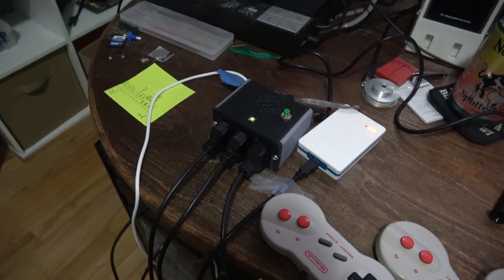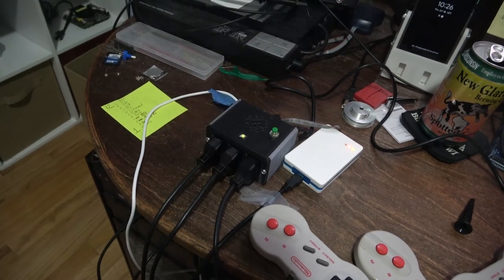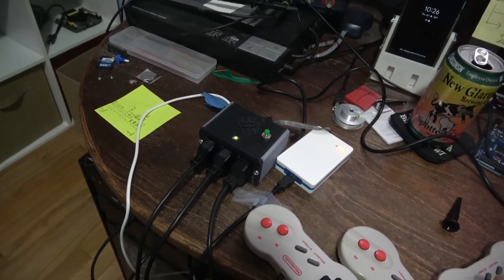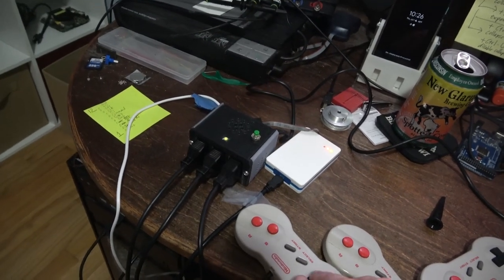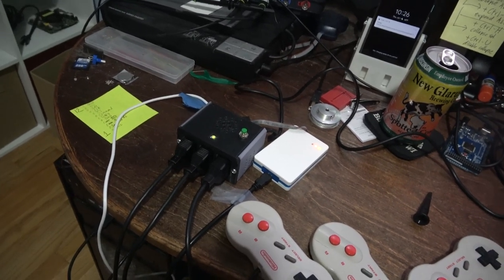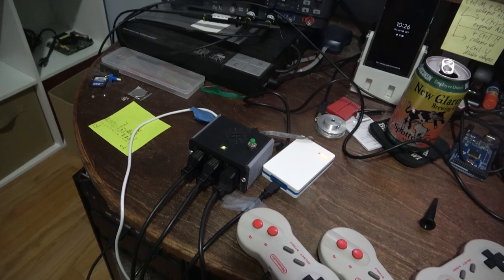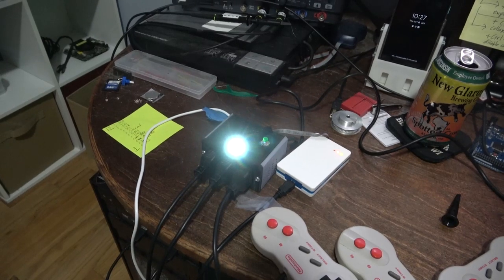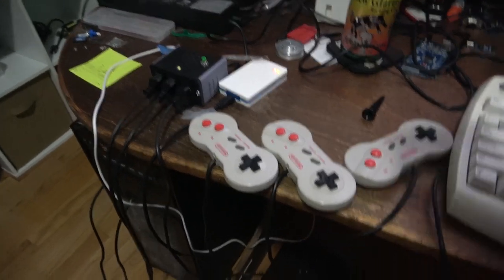I've adjusted the code. It normally goes in a loop or in a chain. However, it makes sure that nobody has the same controls twice. Although about one fourth or one fifth of the time, it will randomly select which state to go to. So it uses the ADC to create a random number, and in that case, it randomly picks a state. So it kind of seeds the randomness a little bit more, because otherwise people will hack the system. Well, I think this should be pretty good. So yeah, there you go.